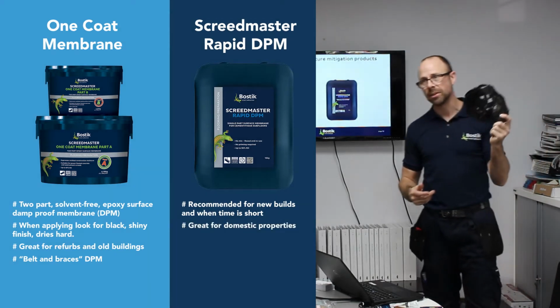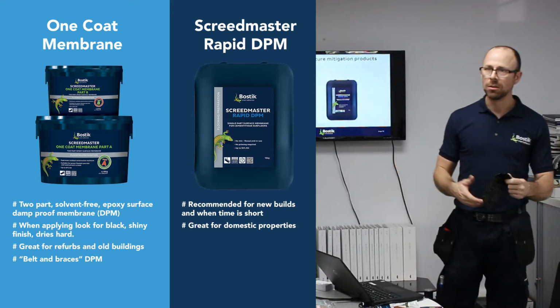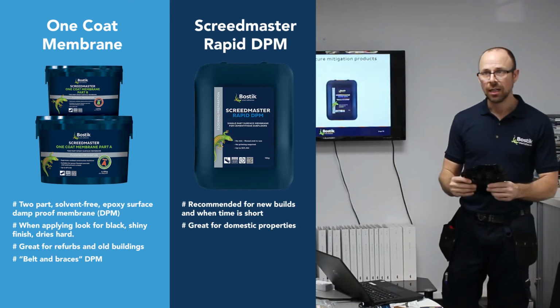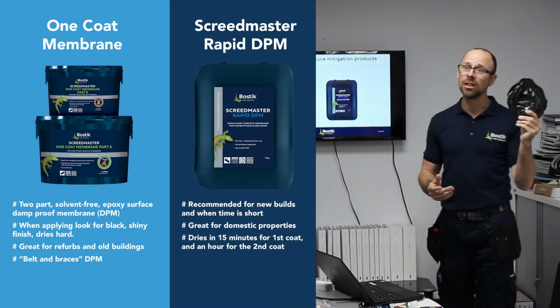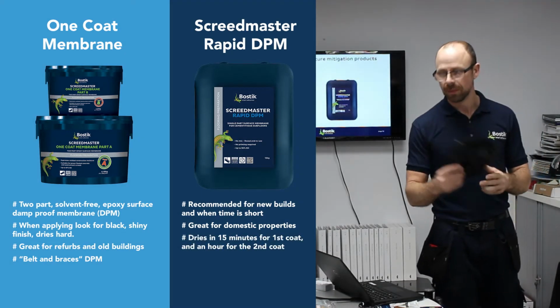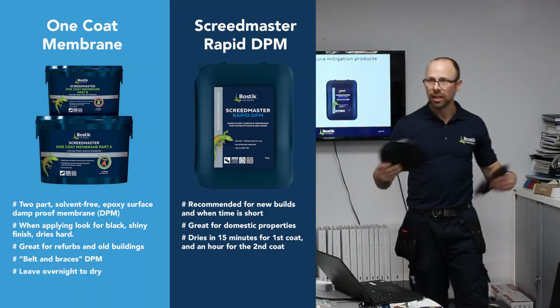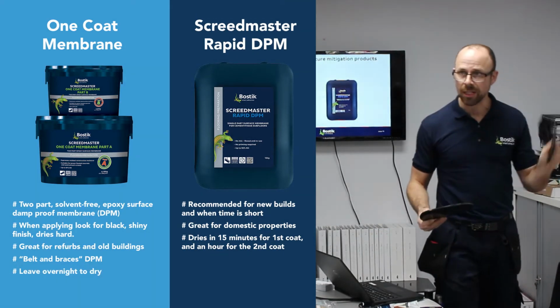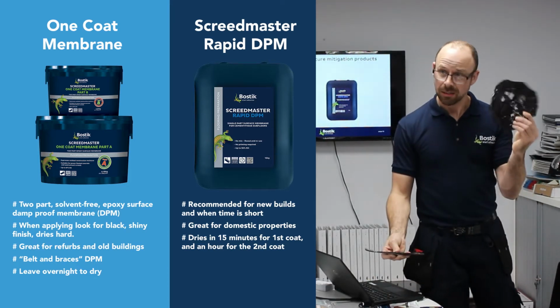A lot of people use this domestically because it's a sand cement floor: just roll apply two coats and the job's done. It dries in 15 minutes for the first coat, an hour for the second coat. This one, you basically have to leave overnight to dry, because it's a chemical reaction occurring. This is just water evaporating out of it. But belt and braces does the job.